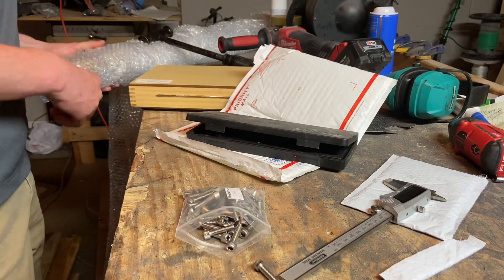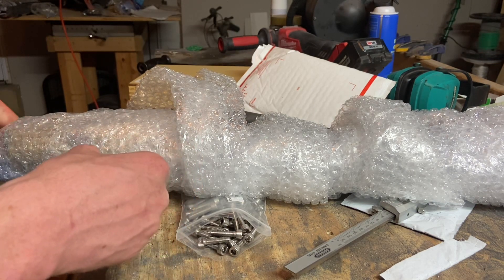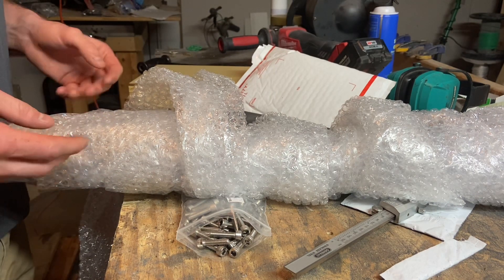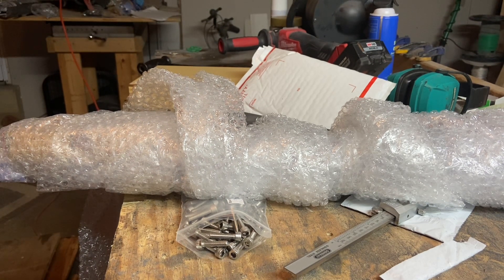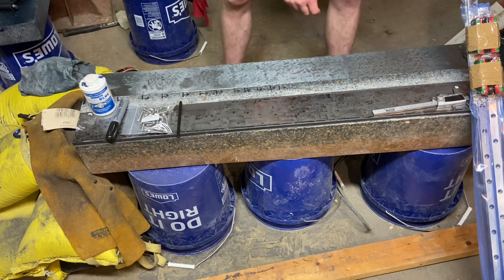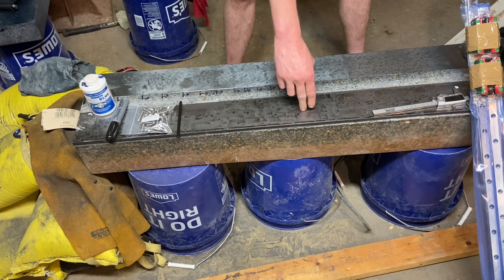You can see I've got my linear rails here. I probably won't unpack these now, but these are HiWin HG 30mm linear rails with the four flange blocks for the two rails. Those are going to be going on the main ways inserts. My plan is to have a rail pretty close on this side, about a half inch off this face, and then my second rail on this closer insert about three inches off this face.